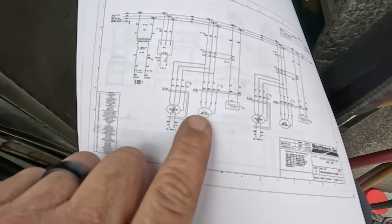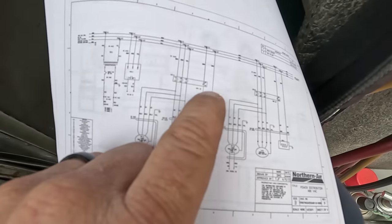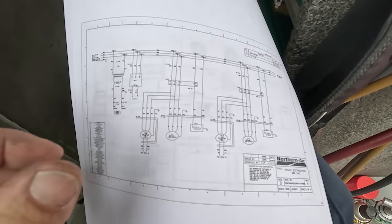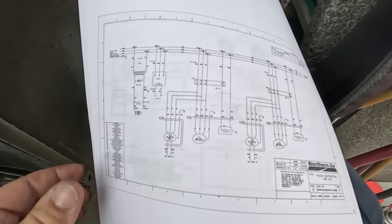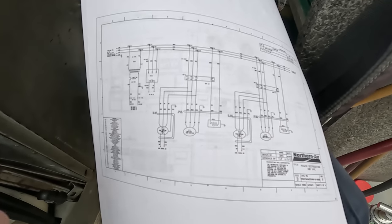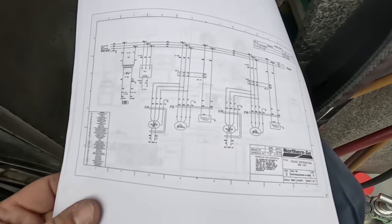Condenser fan, compressor here. Got the crankcase heater here, the break in one side of it here on the contactor. So two items are on one, two items on the other. So you have two compressors. You turn on, obviously, their own. So they did not break that crankcase heater, but that wouldn't make any noise. So it makes me wonder which one's actually making noises. We may have to shove the contactor in and see. I don't know yet. This kind of sucks because there's no history. We weren't the one that worked on it. Somebody else must have.